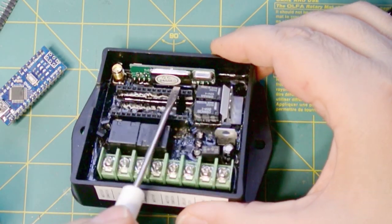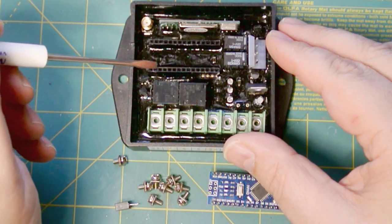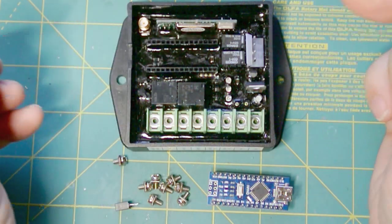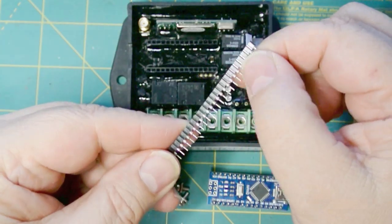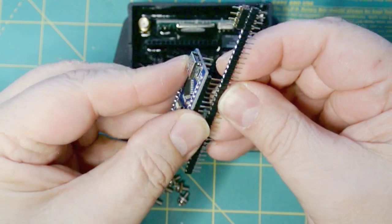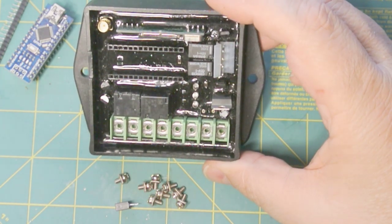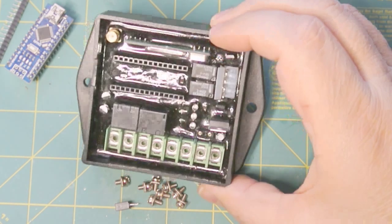What I want to do is take some of this conformal coating and pour it along the base of these sockets. Make sure you don't get any in the top of the socket — I want to put some along both sides of the socket, on the inside and outside. Because what happens is when we pour the potting compound, it will tend to wick up into the socket. If that happens, you're not going to be able to get the parts back in. An alternative — and I'll put the source on the website — is you can use these low profile headers. They're a little more expensive but sometimes they're worth it. They don't have any way on the bottom side that the potting compound can wick up into. If you use them, you have to use the matching male headers that fit into here, because the standard headers won't fit. We've already gone ahead and potted this, and to save time I'm not showing that in this video. I've shown it several times in some of my previous videos on these construction projects.